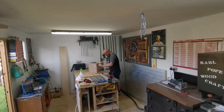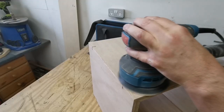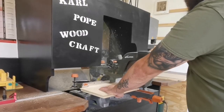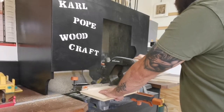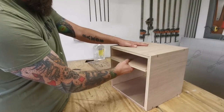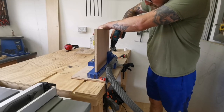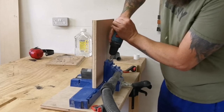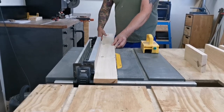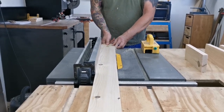When sanding the splines down flush with the rest of the box, just be careful not to sand through the veneer. Next I take a referential measurement of the divider that the tray is going to sit on and then cut it over at the mitre saw. Then I put some pocket holes on the underside which are not going to be seen, and I can later fill these with some nine-millimetre dowels. To construct the drawer I'm using offcuts of pine that I had left over and I'm just ripping them down to size on the table saw.